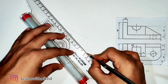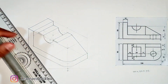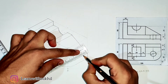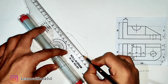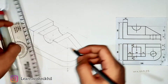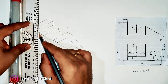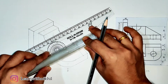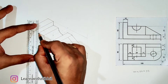Now join the slant line from here. The thickness of this slant line is 10 millimeters. Mark the point at 10 mm, and through that point draw a parallel slant line using this as reference. This part is done. Now create the box shape — draw lines downward lightly using the edge as the reference line, then make them dark once they intersect.